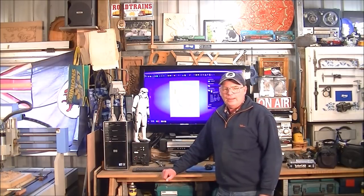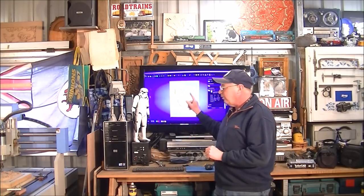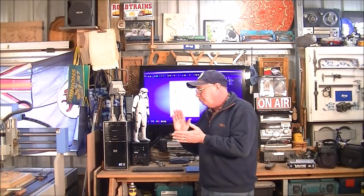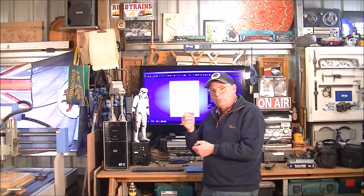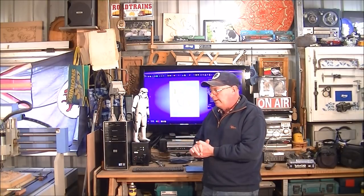And welcome back. So in this video, we're going to cut this with Gwen, my CNC router. First of all, we're going to do a roughing cut with a 6mm ball mill. Then we're going to do a finishing cut with a 3mm ball mill, and we'll see what sort of job it turns out. And if it's not quite crisp enough, we'll put a 1.5mm ball mill through the same job to bring the clarity of it up.